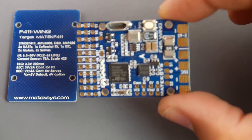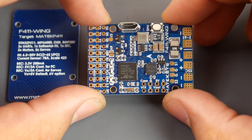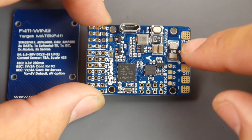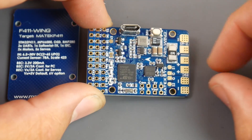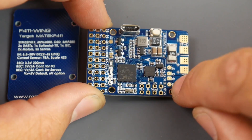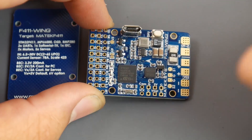The board design is actually pretty spectacular. It uses an MPU6000 gyro, has OSD, a barometer, two UARTs, one soft serial, one I2C, and two motor outputs. There's the power input for your ESCs, then S1 and ground to control ESC1, and S2 and ground to control ESC2. You can mix and match — ground, ground, positive, positive — as long as you get the input correct.